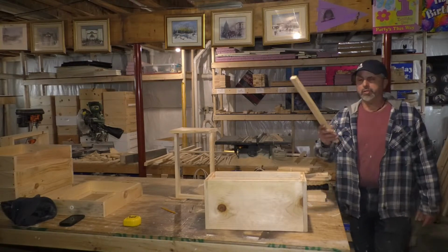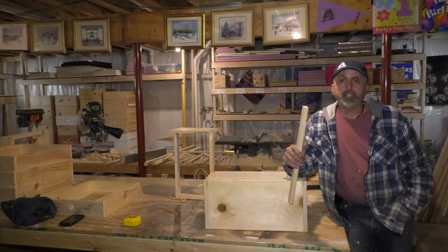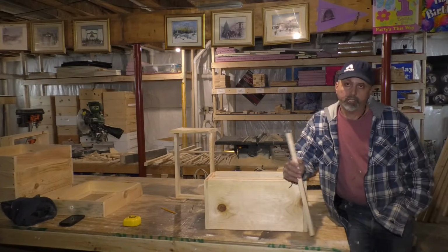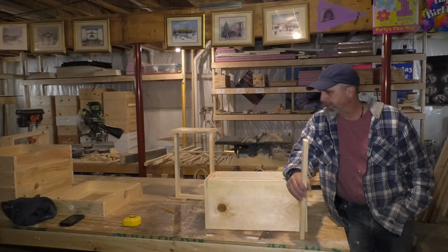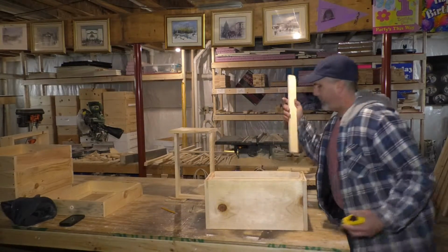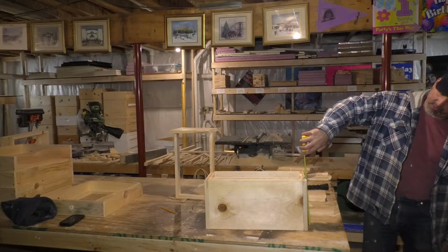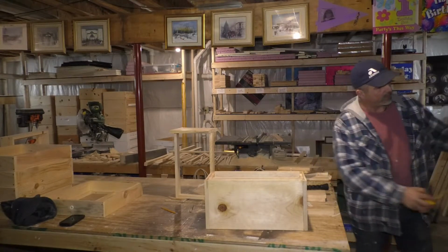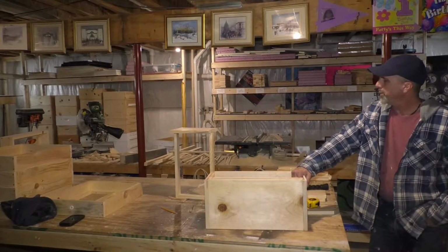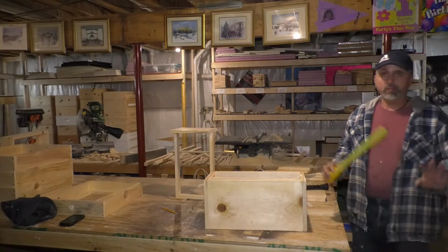when you're cutting your boards, when you buy your lumber, like I've said in previous videos, you need a 1x12 to make a deep, okay? If you buy a 1x12x12, that will build you 2 boxes. Or a 6-foot board will build you 1 box. But you need a 1x12, but the dimension for a 1x12 for the deep is not quite 12 inches. What is it? It is 9 3/4, and same as this one, yeah, 9 3/4. But you need a 1x12 because a 1x10, not a 1x12, a 1x12. I got it right.